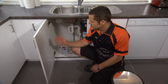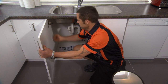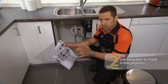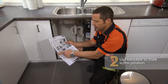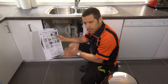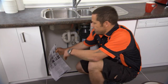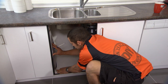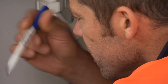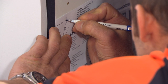Just to make life easy, I'm going to clip off our cabinetry door. There's a little button at the back here — just push that in and the door just pops off. All I'm going to do is fix this template to the side of our unit. We've got a big arrow here — we have to make sure that is hard to the front of the carcass of the unit, and also make sure the arrow is hard down onto the bottom. I'm just going to use a little vivid to mark the holes where we're going to insert our screws.